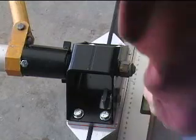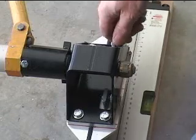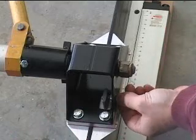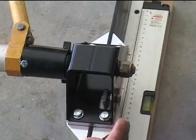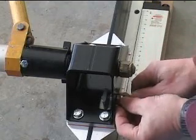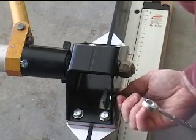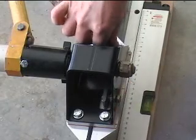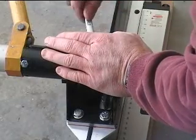I've found that my runner is about an inch out of alignment. So I've loosened these bolts up here — this bolt allows the chalk and runner to move this way. I'm going to loosen this adjustment bolt until the center line hits the mark. In this case I need to loosen it. Now it is dead on, and all I need to do is tighten these bolts back up. And we're set about as perfect as you can get it.